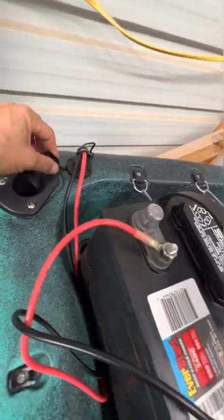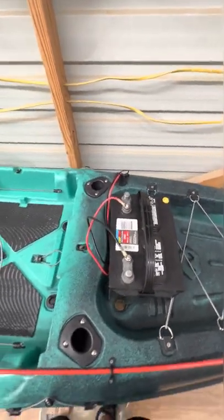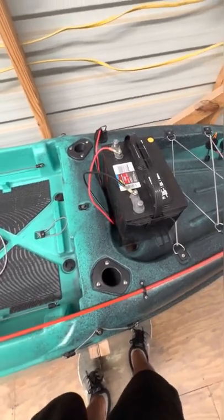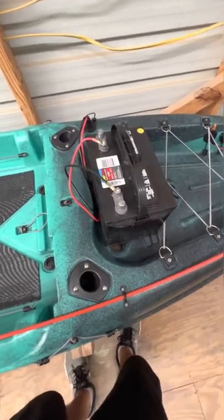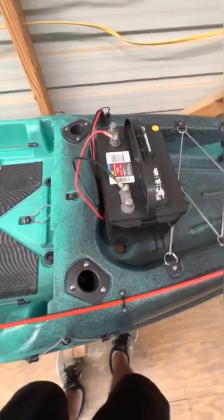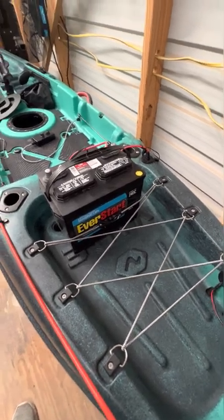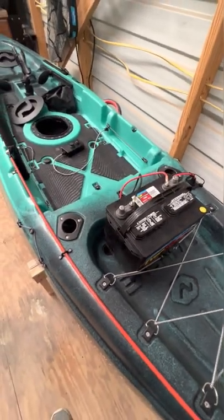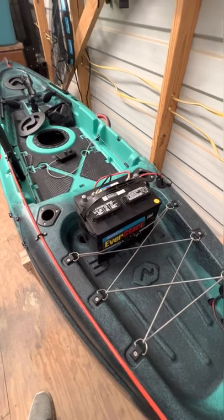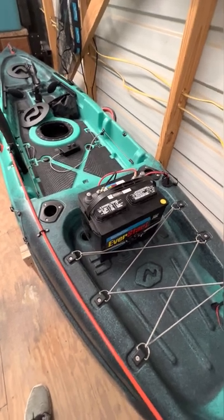For wiring to the battery, I have that on an outlet here, but I plan on changing those wires — I need to get a 60-amp circuit breaker. Really I just plan on getting the Minn Kota battery box that has all that built in, then I can tidy up the wires. The battery I have is an EverStart Marine 24 DC from Walmart. It seems to give you about four hours on a Minn Kota C2 30, which is plenty enough for me.